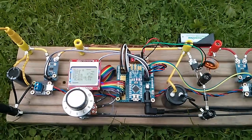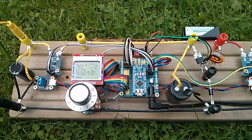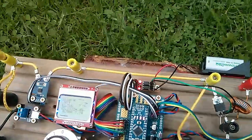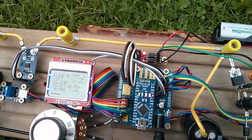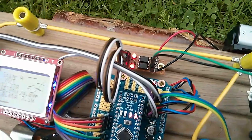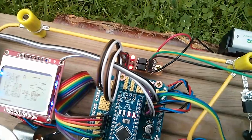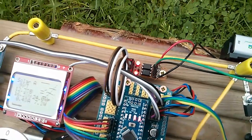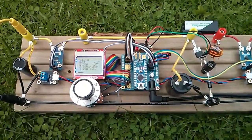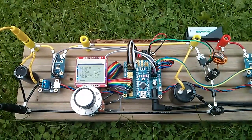The way this works: before I put in the line of code that looks for a change in solar panel power, I built a mechanism which sweeps the PWM from one end of the range to the other. The two red lights on the MOSFET driver just sweep to one end and back, bouncing off the ends and changing direction. That direction-change is critical, because the actual MPPT algorithm is just one line: if the power this time is less than the power last time, change the direction of sweep. Simply that.